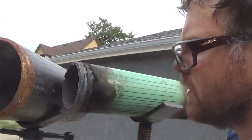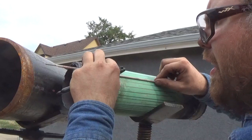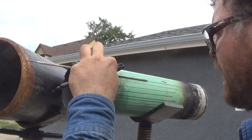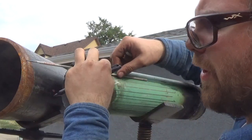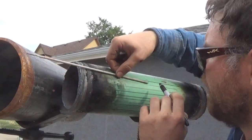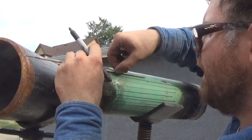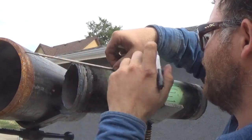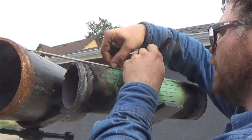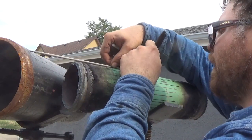Three quarters off the top and two inches off the bottom — that's what our print calls for. You're going to run the rod straight down. You want to drive the rod and have your helper mark the pipe. As soon as that rod touches the pipe, you just mark it, then go to the next line and mark it — all the way around.